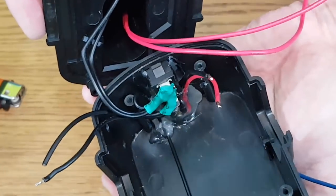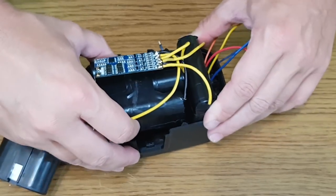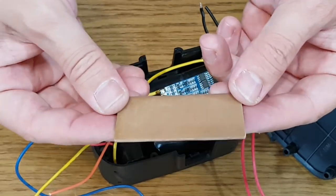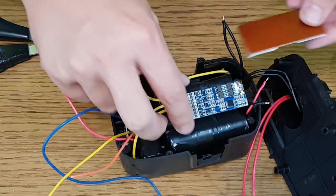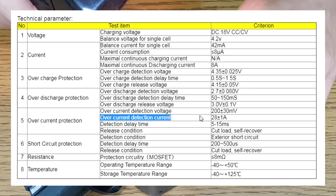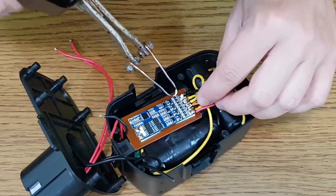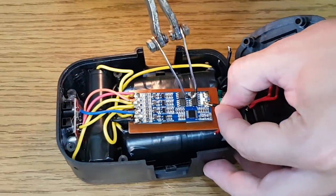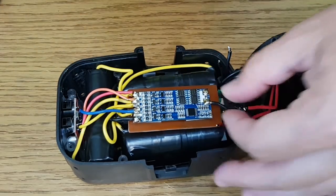Shrinking tubes will insulate all exposed wires. With all the wires and modules, the battery pack barely fits in the holder. The charging module can warm up a bit at maximum current, so I'll use a piece of copper-clad board — with the copper removed — to insulate it from the cells, fixed with double-sided foam tape. The protection board's maximum continuous current is 8A, but it can handle peak current well above that. Still, as a precaution I don't want to exceed 10A. It's time to solder the rest of the wires according to the schematic. The switch is connected on the negative terminal and cuts off power to the voltmeter and the cordless drill.